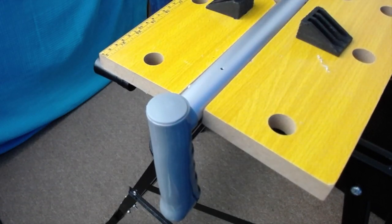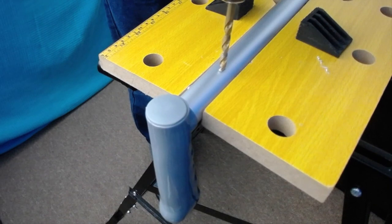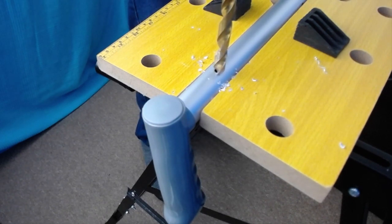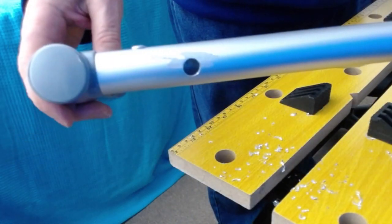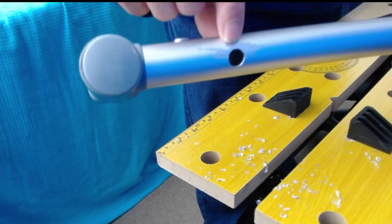It depends — sometimes you can go straight to the 10 millimeter size if your drill is powerful enough, the drills are sharp, and you've got a vice or workbench to grip it. When drilling out the full-size 10 millimeter hole without a workbench or sturdy vice, be careful because the drill can catch in the stick and try to spin it around — you need a really firm grip on both the drill and the stick. We end up with a 10 millimeter hole drilled about two inches from the top of the tube, then file it smooth to remove any rough edges.